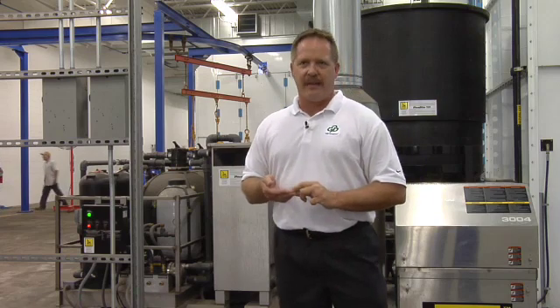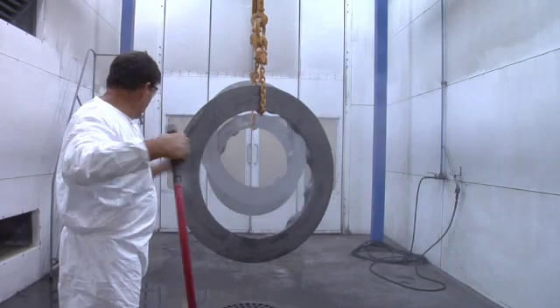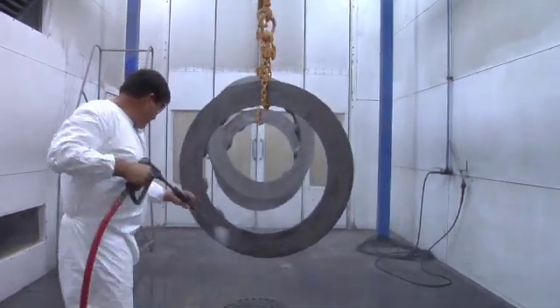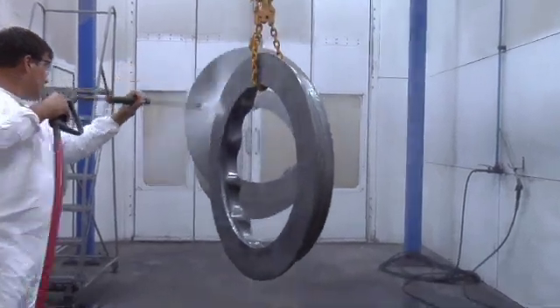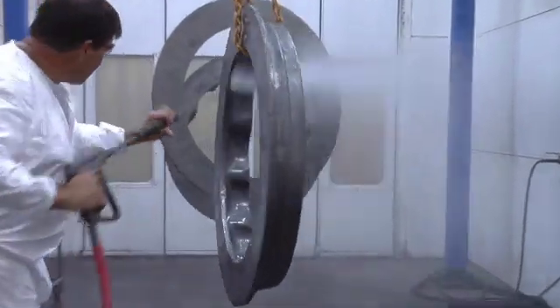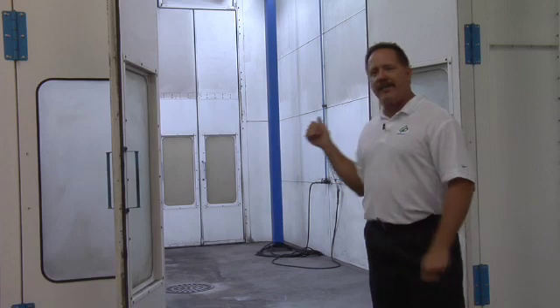Our customers have loved it to date. The iron phosphate has done a real good job with corrosion resistance, and we've had great luck with it. Here's our spray wash booth — it isn't just a spray wash booth, it's also used for inspection. It's a powder-coated steel booth designed to be a paint booth. We've got good inspection lights in it, so we can inspect parts prior to wash, inspect welds, and inspect after we wash.